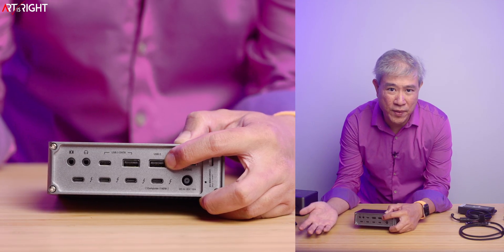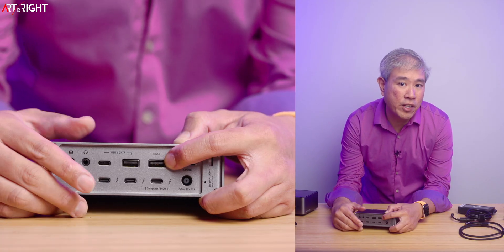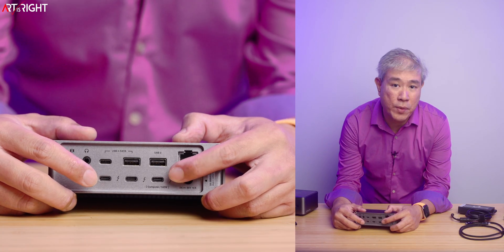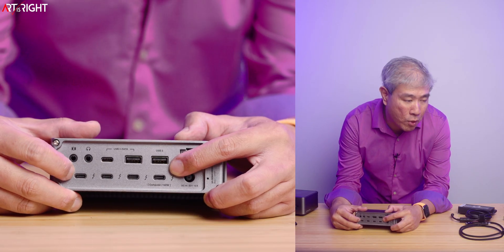You can use a Thunderbolt connector to bring the audio signal via that cable using the internal DAC. The CalDigit TS5 has four total Thunderbolt connection ports on the back — one uplink to the computer closest to the barrel connector, plus three downstream ports, which is one more than the Anker's two. However, since there's no HDMI or DisplayPort, if you need to connect a display using those connections, you'll need a USB-C to HDMI or DisplayPort adapter. This limits connectivity compared to the Anker, which has HDMI and DisplayPort built in, giving you more flexibility to plug into different display types right away.